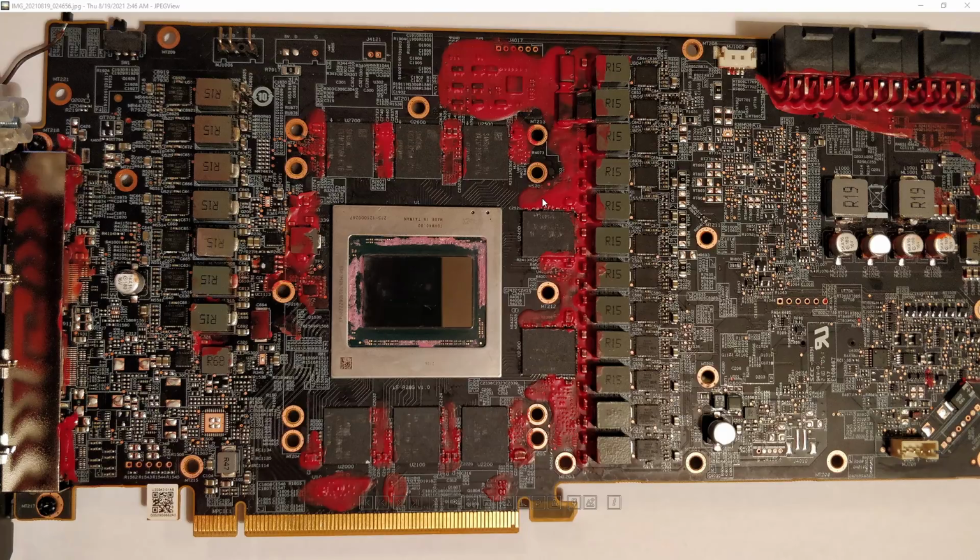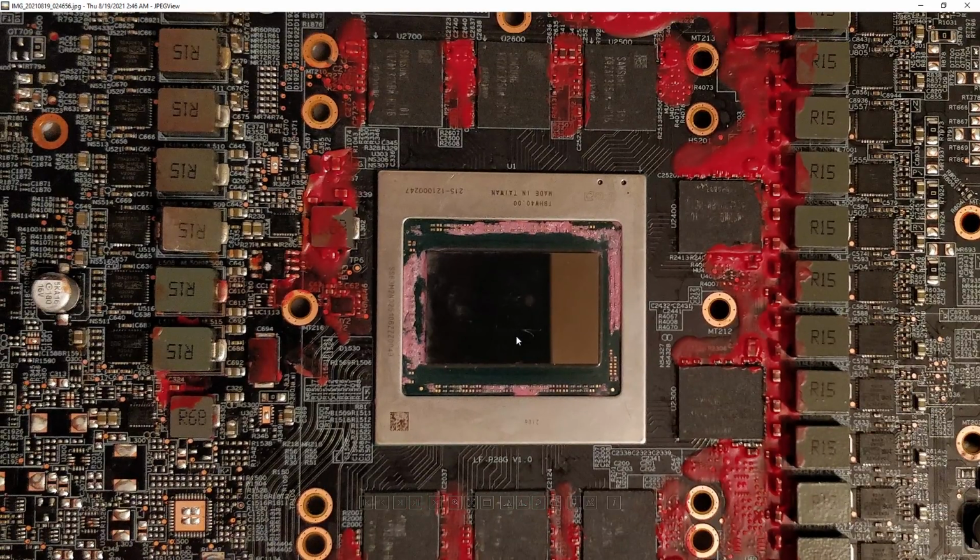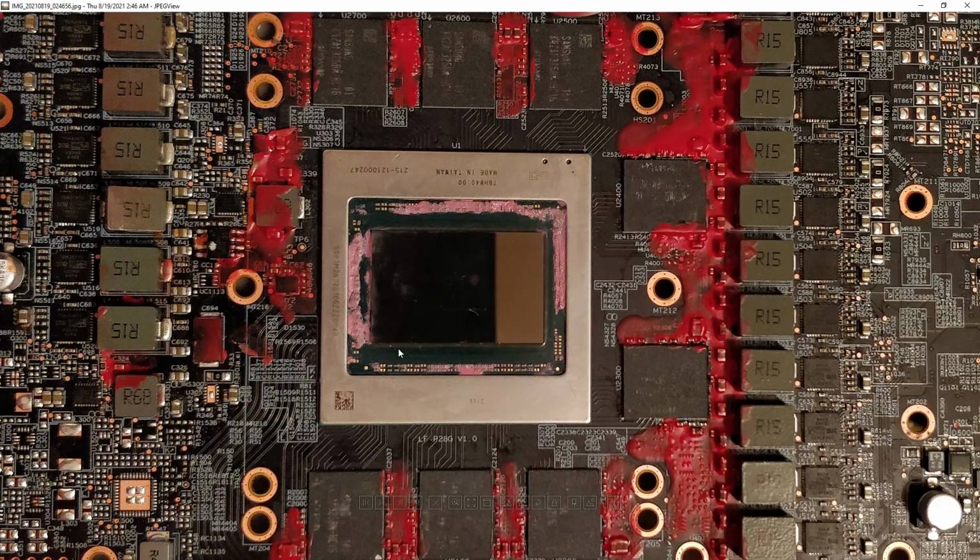And yeah, so that's the bad news. And I guess what's kind of neat is, I get the most visual representation of what a high side MOSFET failure can do. Because normally, there's plenty of cards and CPUs out there where the motherboard has a high side MOSFET fail and it kills the CPU, or you have a GPU where the high side MOSFET fails, it kills the chip. But you don't usually get so much energy dumped into the chip during those events that it actually creates a crack like this. I'm thinking of sending the chip off to somebody to get an x-ray of it, because I imagine the internals of the chip right now look like a bomb went off. I think that might be kind of interesting to look at.